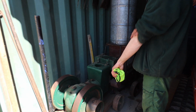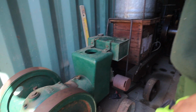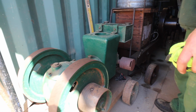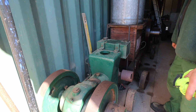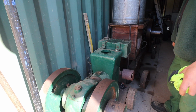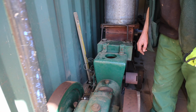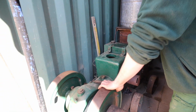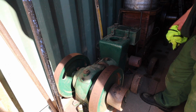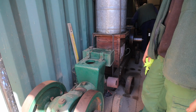Right, that's a Bradford engine, petrol paraffin Bradford, made in Yorkshire I think. It's a horizontal engine, not open cranks though, all enclosed crank. I've got the magneto, it has a brass Wyco magneto on it. And two flywheels? Two flywheels, yeah. Is that to balance the engine, do you think? It's just how they are, Robin, that's how they made them.